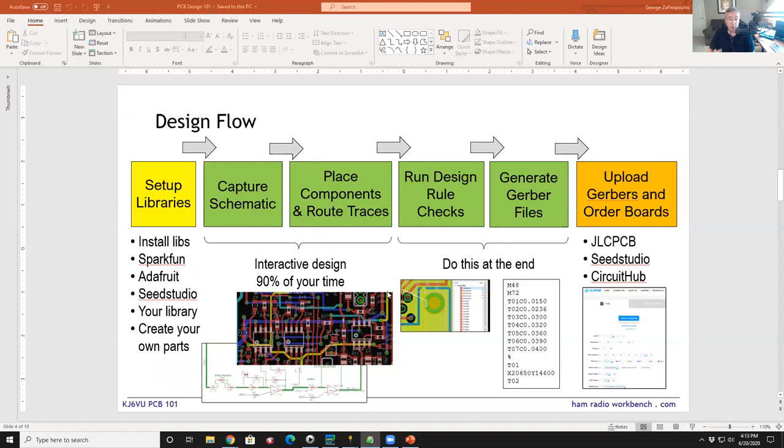And then when you bring up the tool, it'll either recognize it automatically or you click a dot to turn it on. And now you've got the library. So it's quite trivial. Okay, so then doing a design, you basically capture the schematic diagram with the graphical editor. And there's always two views to a board design. There's the schematic view, the logical view, if you will, and there's the physical or layout view.